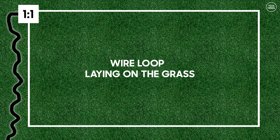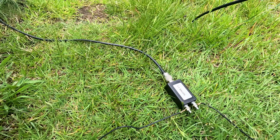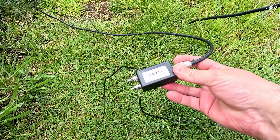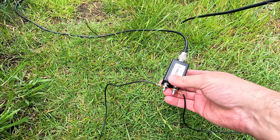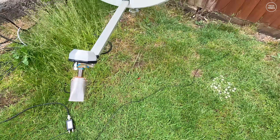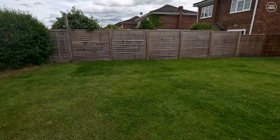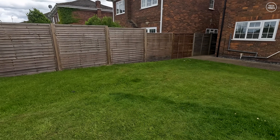This is how I've got it connected: a 50 ohm coax feed goes off to the shack and is attached to this one-to-one balun, with the wires connected to either side of the balun on those two terminals. The wire starts going along here parallel with the end fence, then down the side fence, then parallel with the back of the house, and then back up alongside the conservatory to the other side of the balun.